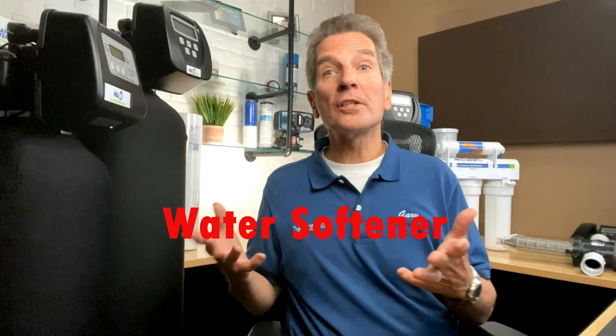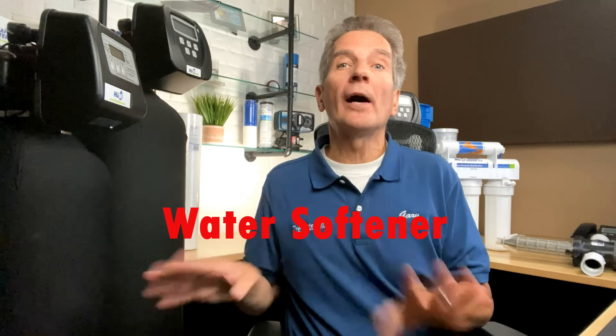If your water is hard, next up is a fully metered water softener. Water softeners do more than just soften your water — they also remove iron and manganese. If you have iron less than one part per million and no sulfur, you don't need an iron and sulfur filter; a water softener will handle it. A water softener uses salt to make brine to regenerate. Ongoing maintenance involves adding bags of water softener salt, and how many bags depends on various parameters — I've got a YouTube video below that explains it.